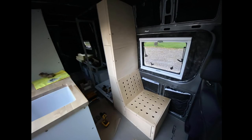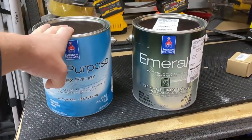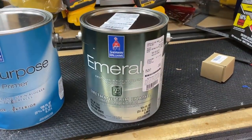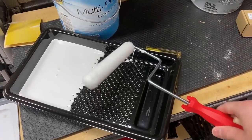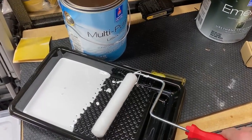I was literally so tired when I finished these panels that I forgot to record a clip of the finished product — thankfully I took one photo when I uploaded to Instagram. Now we're going to paint these panels, doing the exact same thing as painting the rest of the panels in the van: one coat of multipurpose primer, two coats of Sherwin-Williams enamel — it's kind of like paint but it dries a little bit harder. I use a quarter-inch nap roller, preferring the six-inch size, and I'll put a link to all of the painting components in the description.